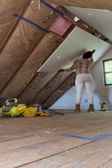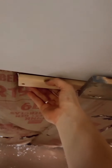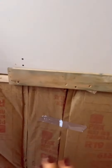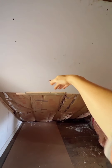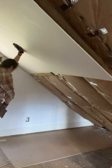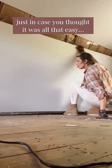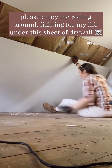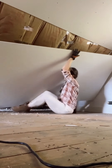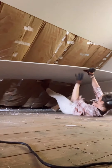Eventually I took a hint and decided we needed drywall in this space to have something to attach to. I figured out how to do that myself by using a jig that I attached to the studs — lifted it up, slid it in the jig, and then I was able to screw it into the studs. The jig is a 1x2 board and a 1x4 board glued together with wood screws. Pre-drill the holes where you can put some long wood screws through for the studs. Even with the jig, these angled walls are rough. This is me fighting for my life under this sheet of drywall.